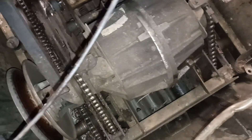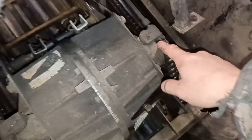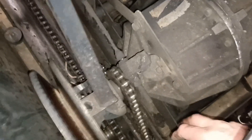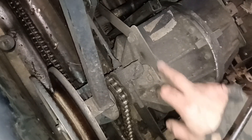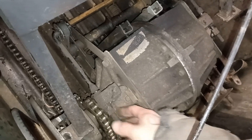So we've shifted the engine forward. I didn't have to take the fuel line, throttle cable, or choke off, but I did take the wiring harness off. Now we're down to the transmission area - this is a T20 transmission, basically used as a skid loader transmission. These are the two shifter areas and there's what's called a diamond plate on each side with a retainer bracket on top. This one looks like it's way out of adjustment, and that might be part of our problem - if these shifter arms don't shift at the same time, they can't drop into gear.